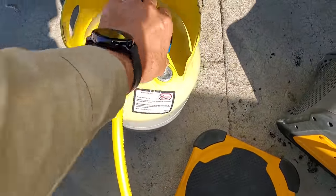Watching the gauges on the manifold or on the tablet over there. Adding refrigerant as we speak, making sure I don't overload it, using this ball valve as my guide right here. A little bit at a time, we're at 5 pounds. It takes 11 pounds, 8 ounces of R22. I'm pretty confident that we're not going to flood it with liquid because we're feeding through a low loss fitting right there, and we're feeding through a Schrader. So it's getting metered, basically.